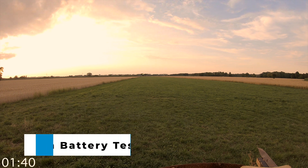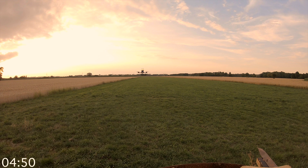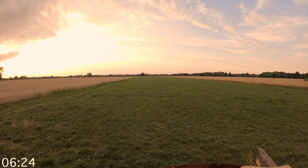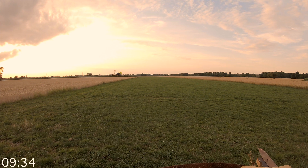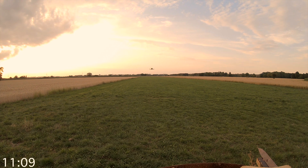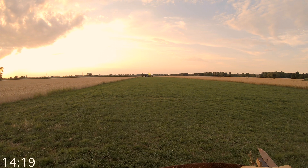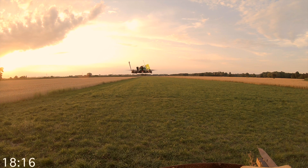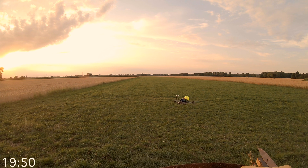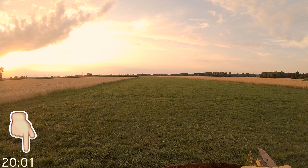Lithium-ion battery is next — similar test. A couple of times I went under the drone just to blow the bugs off me; I got eaten alive by mosquitoes out there. We extracted 2,876mAh indicated, which is roughly 92 to 95% of the capacity — some stores rate these cells at 3,000mAh and others at 3,130mAh. A very respectable 20 minutes of flight time out of this battery.